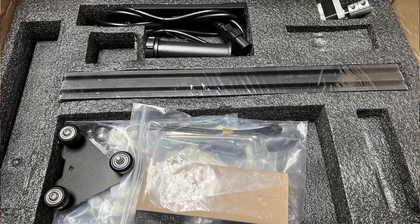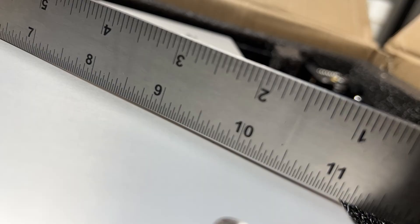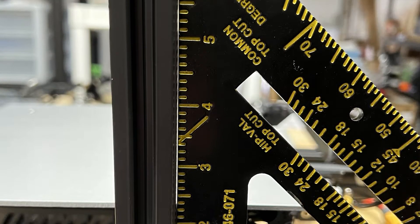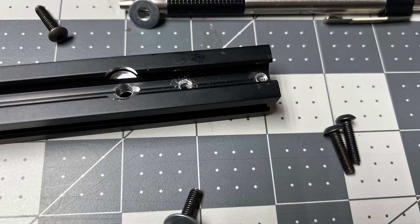One after another, I see problems with the parts I received. There was no build surface, the hotbed plate was wildly warped, it was missing M4 screws, a stepper motor was dangerously placed back in the box, the vertical rails aren't square, the leveling springs are really worn out, and the gantry rail is defective and doesn't even accept the M4 screws.